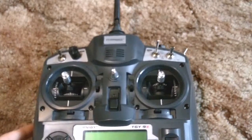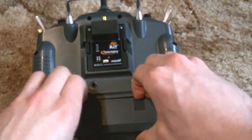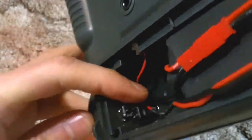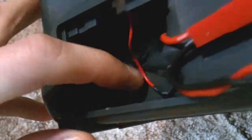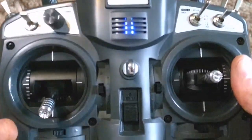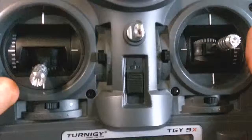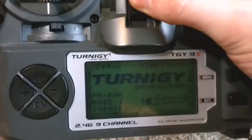You might be saying, hey wait a minute, what about your bind button, or being able to turn it on or off whenever you use another module? I thought of that too, and so back here in the battery bay I have a little push button switch — that's the bind button now — and I also have a sliding switch here to turn the module on or off. Whenever I turn it on, I've also added a blue LED up there so you can clearly tell that the internal system is on. Whenever I turn the switch to off and turn it back on, it doesn't come on, because right now the system is not powered.